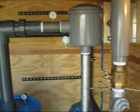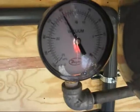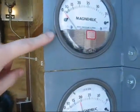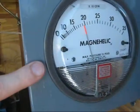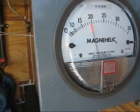This is our vacuum and flow test for system 1342. You can see we're at 60 inches of water column vacuum. Our dilution line is completely shut at the top one. This is showing the flow on the SVE which is just under 200 CFM right now.